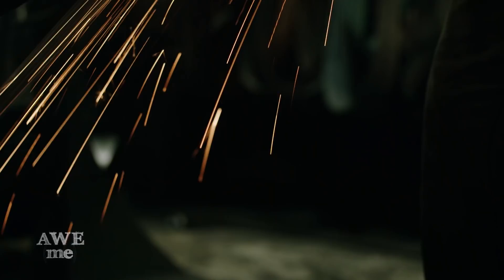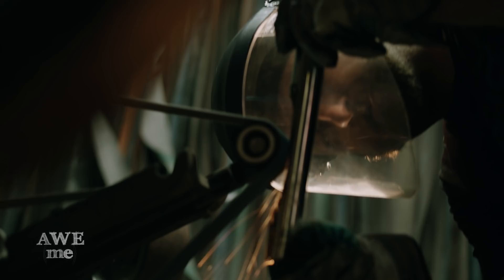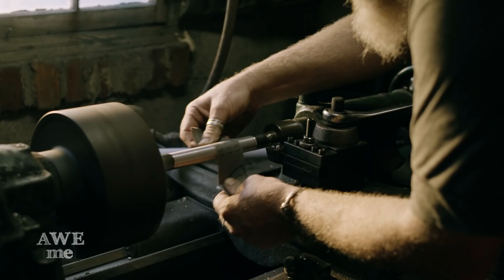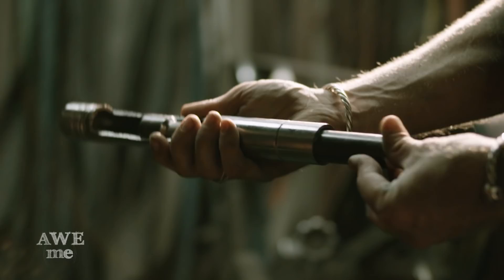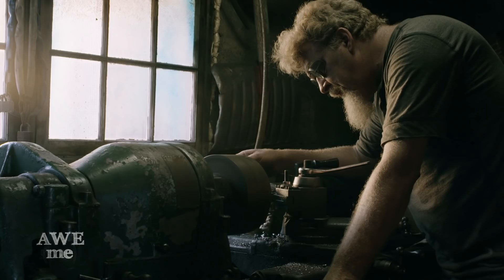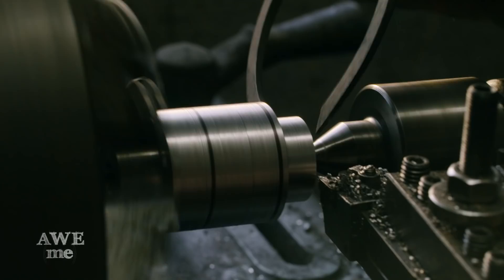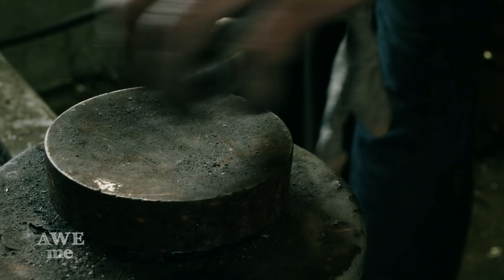Using the 2-inch contact wheel, I grind the lightsaber handle overlay to shape. On the south bend lathe, I relieve and knurl the handle for the lightsaber. I profile the pommel on the south bend lathe. After profiling the shape, I go to the 4-axis mill and index and cut the flange.